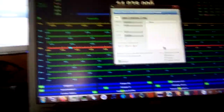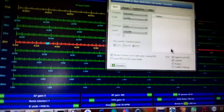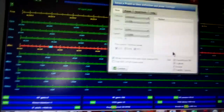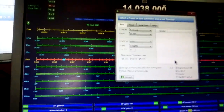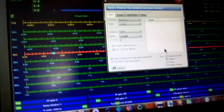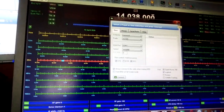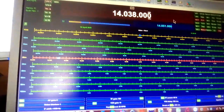Press Connect. It will go through a sequence and connect to your radio. Make sure your radio is switched on and is not in a menu mode or looking at a preset — just in standard VFO. It will go through, and eventually, if it finds your radio, you just get the screen.